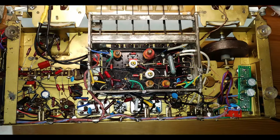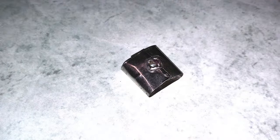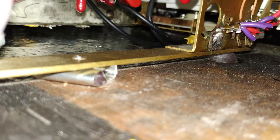Before putting the chassis back in the cabinet, it is necessary to put the grommet spacers. They should be glued on the cabinet or on the chassis, otherwise they would become unmanageable. However, one of the four spacers should wait, because it must be wrapped with some metal sheet to make contact with the shield attached on the bottom of the cabinet.